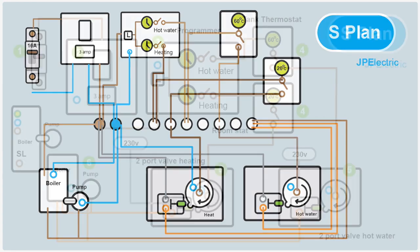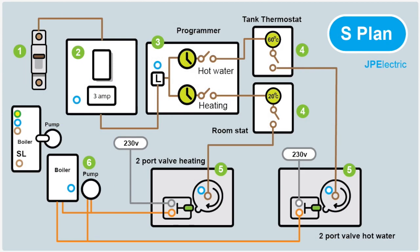So there you go — that's your S-Plan. That's the basic overview, but this is just a generic S-Plan system. Certain systems might have specific requirements, especially the boiler. The boiler is often not just switched on or off — you have different feeds including a permanent live and a switch live. That's because boilers also like to have the pump running after the boiler switches off — this is called pump overrun, and it gets rid of the residual heat from the boiler. So you always need to look at the instructions for your specific boiler. I hope you found it useful — thanks for watching.